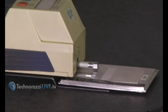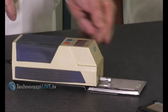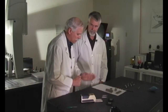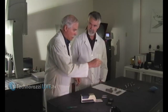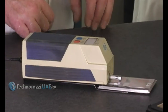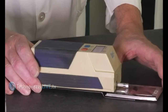Setup on these is very important. Being portable, the tendency might be to just set it down, take a number and go. But this stylus travels in and out — it has to be perpendicular to the lay of the roughness. If it's not, the tracer will still hit the tops of the mountains but won't go all the way down to the valley. So you have to know the grain of the surface you're measuring. We always give a hard look at the surface first to determine where the lines are, then set up perpendicular to it.